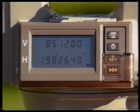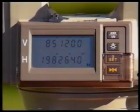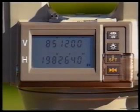The screen also carries an arrow which indicates the direction in which the horizontal circle is graduated from 0 to 360 degrees. In optical reading theodolites, this direction is always clockwise when looking down on the theodolite. In electronic theodolites, however, the facility is provided to reverse this direction. This is very useful if using the theodolite to turn right angles in an anti-clockwise direction.